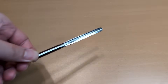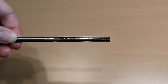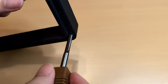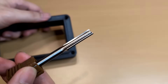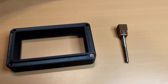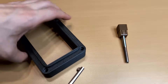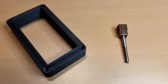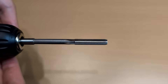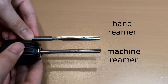To standardize the magnet holes, I first tried using a hand reamer, but the tapered tip didn't work well with shallow non-through holes. I also tested a woodworking bottom-cleaning bit, but the results were inconsistent. Finally, I switched to a machine reamer with a flatter tip, which gave me clean, uniform holes for press-fitting the magnets properly. I avoided glue here because I need the magnets to conduct electricity.